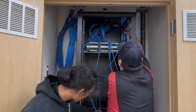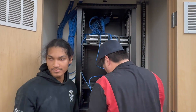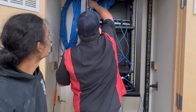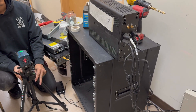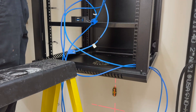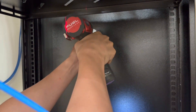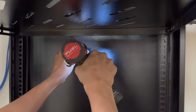Okay, it's on the wall, and it's a lot easier with friends. Now, you probably saw that the only thing holding this on the wall are the toggle bolts that we installed — you probably didn't see me hit any studs. There's only one stud in this entire wall as near as we can tell, so we're going to secure a couple of washers in order to lock it into the stud and give us a lot more support. The rack doesn't weigh anything in the beginning, it's very light, but once all the equipment is in it, it'll be pretty heavy. So we definitely need to be in the stud to give it some support.